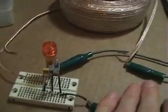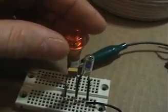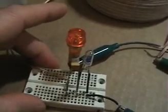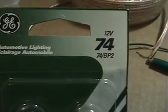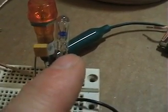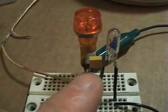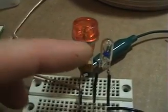The next thing you'll need is a neon bulb — that's a 120 volt neon bulb. And this little light bulb here is an automotive bulb that I use — it's for dash instrument lights, very tiny. What I do is I fold out the leads and I scrape off the finish on it so the solder will stick to it, because it won't stick on the finish.